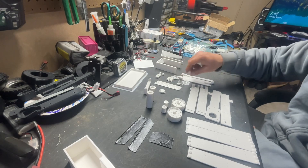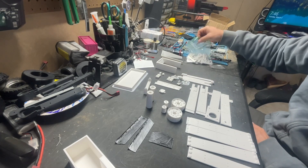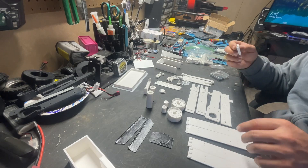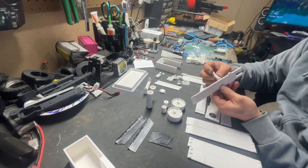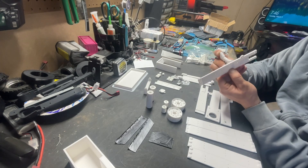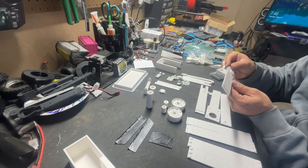Now we're going to go ahead and start putting the rails together. You're going to get your M2 by 10s. What we'll do is we'll probably start on the rail — essentially it goes like that. We'll test that out and we'll be right back. So that's one. I just wanted to point out that I don't use this top hole — unfortunately it's a little too close to this roller, so you don't really need it. You can see that it stays together quite nicely.